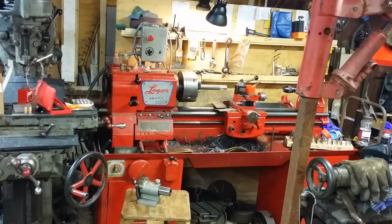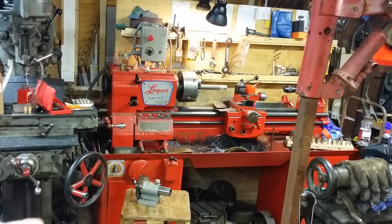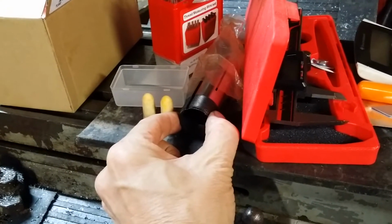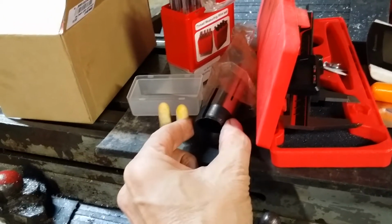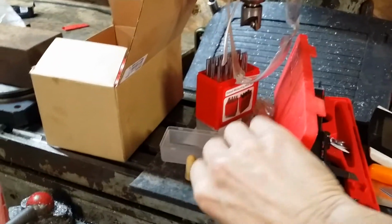And then it dawned on me that a few days back, Joe Pazinski put a video on about a real simple trick to get the internal diameter, I think it's minimum internal diameter, what I needed to turn the ID to so that I could start the threading process. So, based off of the measurements I was getting from the outside of the threads on this, 20 threads per inch, I took 50 thousandths off, and it's pretty close to what I was guessing as far as my minimum inside diameter to start thread cutting.